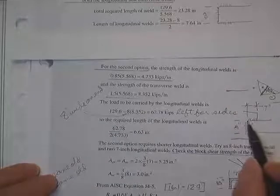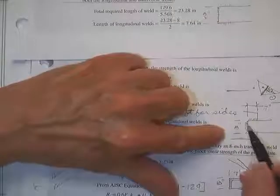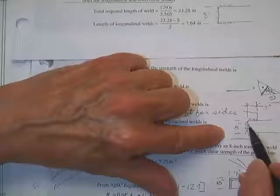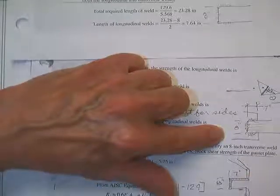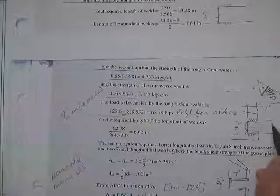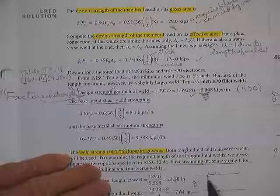No, that's correct. Why not? Because you have a transverse weld. No question, we've been so busy making sure that this distance across here wasn't shorter than these welds, because without that there, we had a U of zero. But as long as we have this across the end, all of these little people can get out these doors, and these can get out these doors very gracefully. There's nobody running over like crazy, like if there's no weld on the end, all trying to get out the side doors and bunching up and causing a U to be less than one. So that's okay.